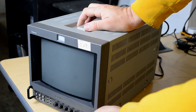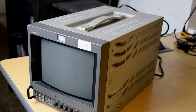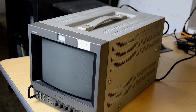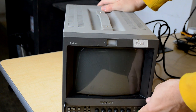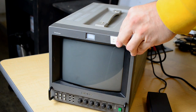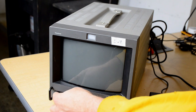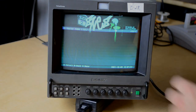First, let's try plugging in the AC power even though I doubt it's going to do anything. I am getting some kind of noise — there's some reaction in that power supply — but it's not transmitting into actual stable power on the screen. Let's turn that off, unplug it, now let's try the homemade DC power supply using the same exact plug, and it sounds like it's normally powering up — the power light's on. I'm going to go ahead and stick a video signal into input one.